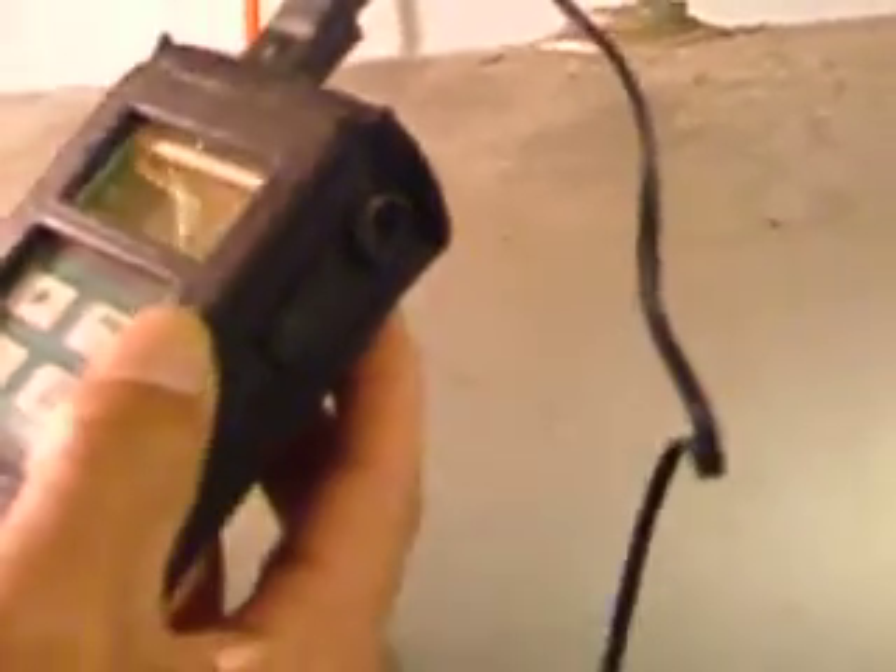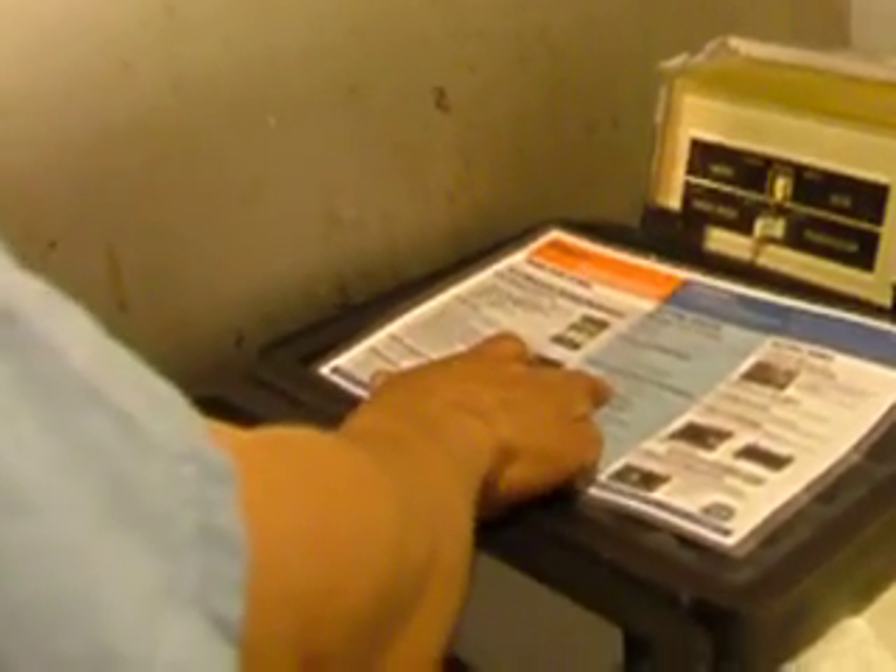If you look at the numbers over here, you see the bar — it's giving you the signal. The number is running right here and it's going to settle at 112. So I come to my reference book over here and I look at 112. Between 0.091 and 0.128, that's telling me there's a 12 gauge tank.